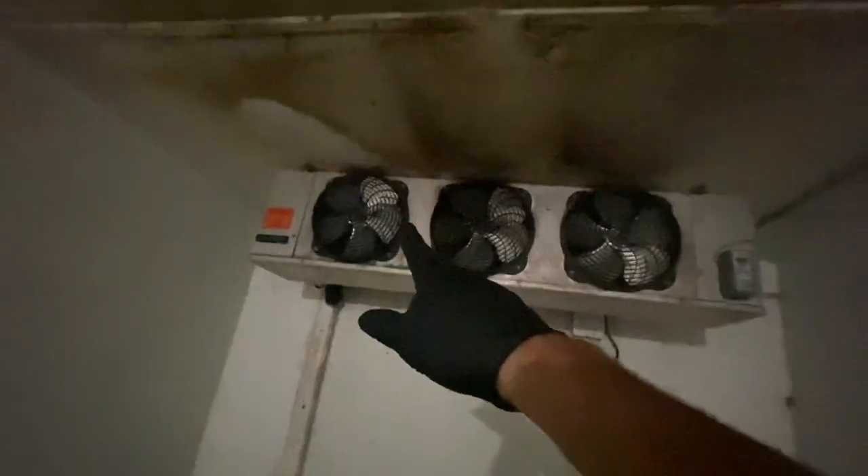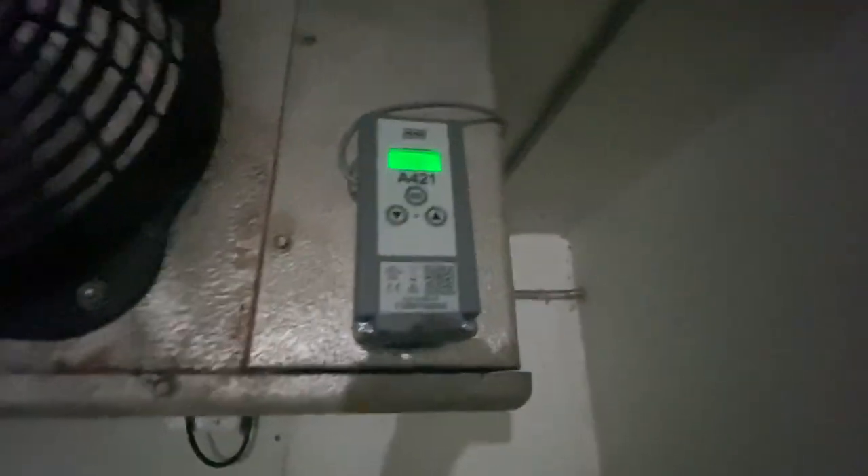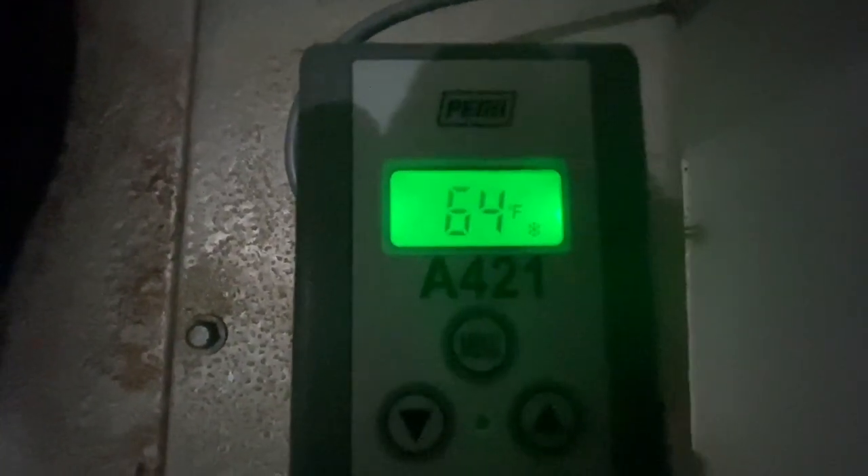Let's go downstairs while we're evacuating. Units up there on the roof. I got one light bulb working. That fan motor and fan blade was bad — I had to replace it. I do have it labeled for the 404. I cleaned it up. We haven't decided what we're going to do with the condensate yet — might just drain it to a bucket for now. We can get the display going, and we're in our time delay of three minutes. It's 64 degrees in here, which isn't bad.